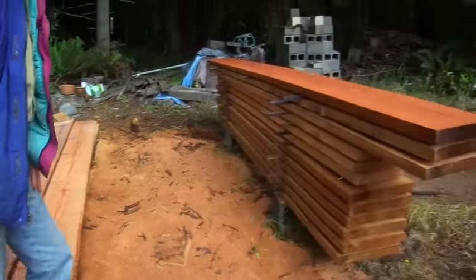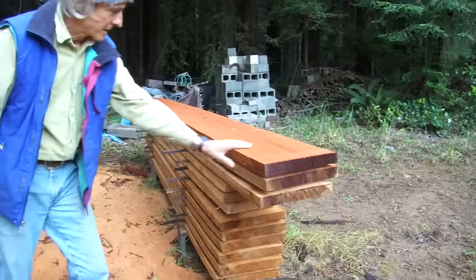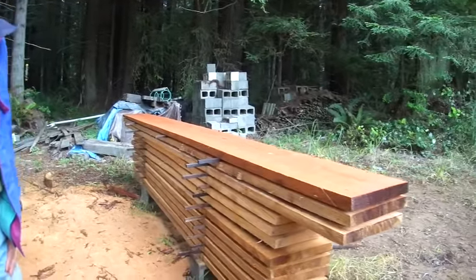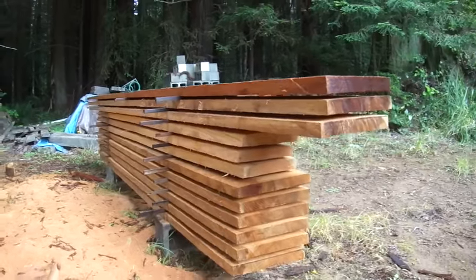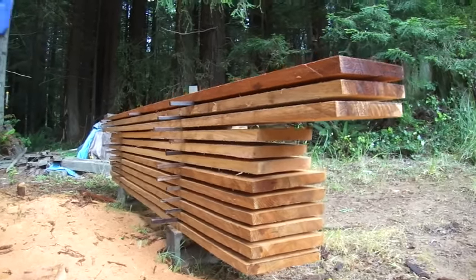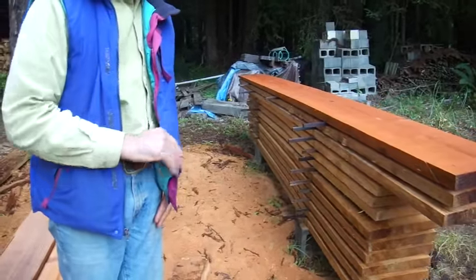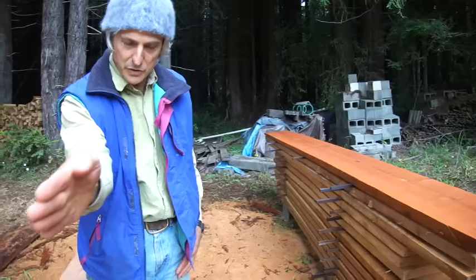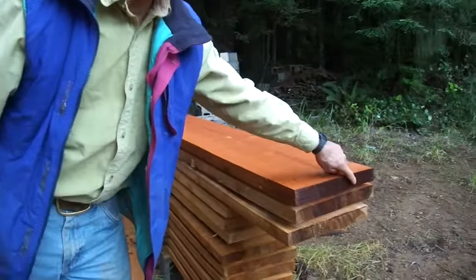Yeah, a cover board is good, and I might recover a little bit of the wood, but not much. And then sometimes you notice that one's 1 inch everywhere, this one goes from about 2 inches to 1 inch, like a triangle. Sometimes the crack that goes through the heart, which is typical in most trees, is not going parallel with my cuts, the way I laid out the log. It'll twist as it moves through. And this one twisted a bit, so there was more waste on one side.